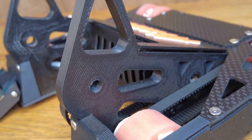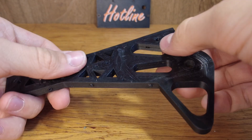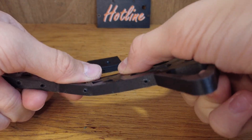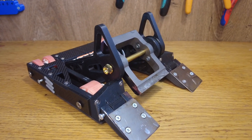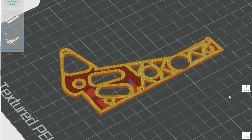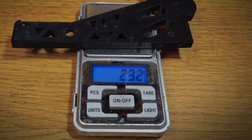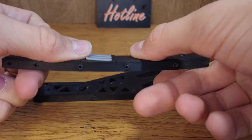One of the most important things are the robot's main rails and the sides. They are all 3D printed out of black polypropylene. I chose this plastic because it acts like TPU, but it actually weighs lighter, and as I try to save weight, this is the perfect option for me. Main rails are both 7mm thick with almost 100% infill, but still light at 20g each. On the other hand, sides are printed with lower infill because they don't need to be that strong.